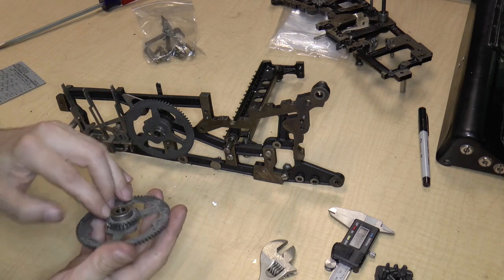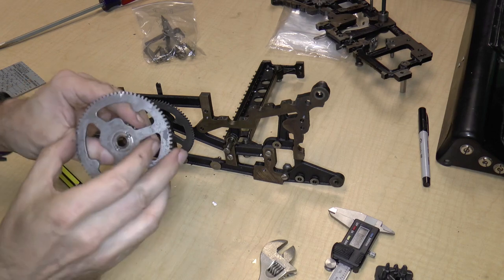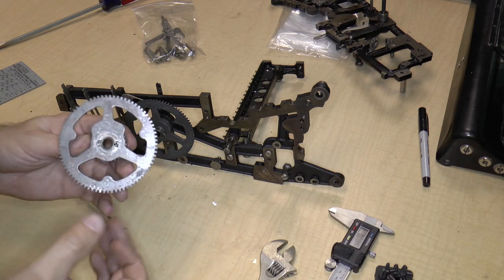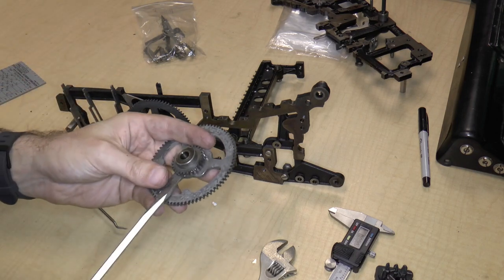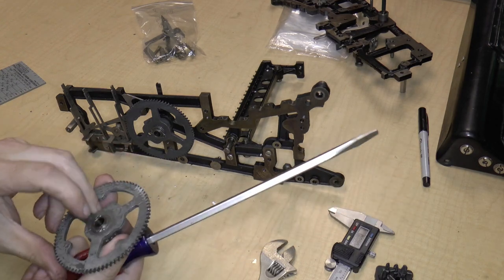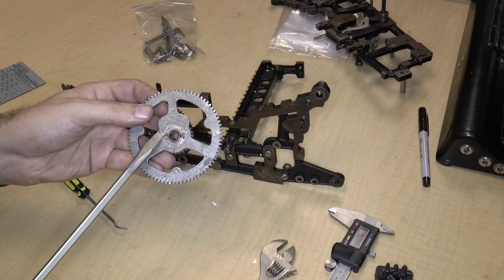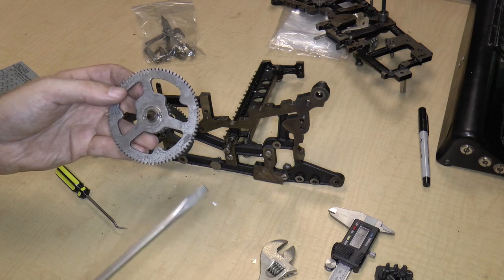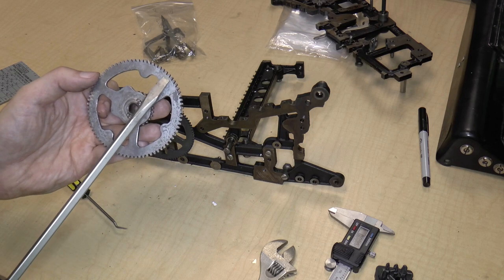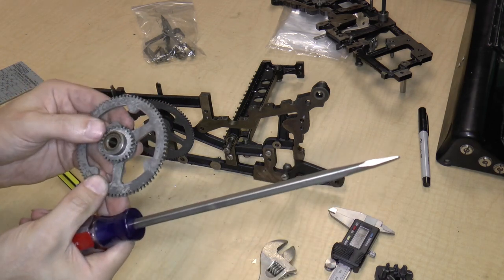This appears to be all one piece. Are we sure it's all one piece? Can we pry this gear out? It doesn't look like it. It really does look like it was made — oh, I see: there are weld marks here. So this actually was two parts. There's an arrow which is a timing mark right over there, along with the two arrows on the outside which are for the bigger gears. Presumably this arrow corresponds to something on the other side — remember that the Leibniz axle actually sat over here, so presumably there must be another timing mark on the Leibniz wheel.